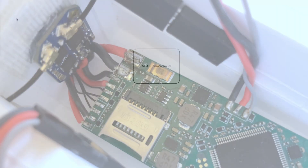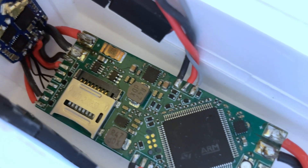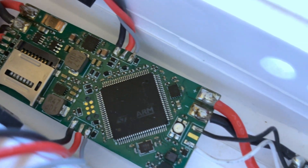I started the project by designing the flight controller board. The heart of the board is the microcontroller. There are many families of microcontrollers from different companies. I decided to go for STM32H7. It is a series of very powerful chips, which allows me to write the software easily without worrying too much about compute power or memory. The board contains a couple of sensors. IMU, or Inertial Measurement Unit, measures acceleration and angular velocity. This will allow me to estimate the rotation and motion of the plane.